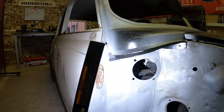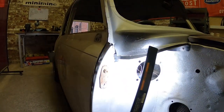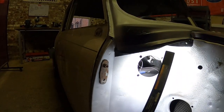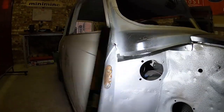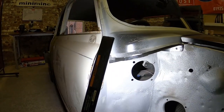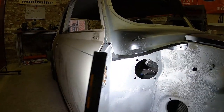My way of fitting this is little stitches along the back, along there, and then just join it on there. It doesn't have to be mad but it does add a lot more structure back into your car. All the joins need to be sealed up inside there before anything else. But before we do this, we're going to start painting — get some zinc primer on there first, white paint on top, and get this panel ready to go in.